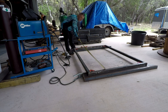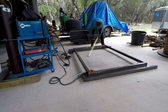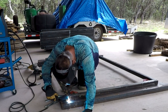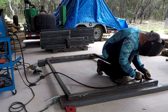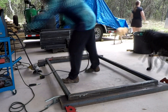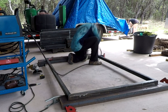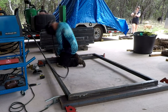After measuring to make sure the diagonals are true, I started welding. I tack weld every corner, then take the magnet off. I changed my method a little bit later on — I started doing more of a seam weld once I knew it was true. I put the bead on there and started doing longer welds on each corner as I went through the whole rectangle process.